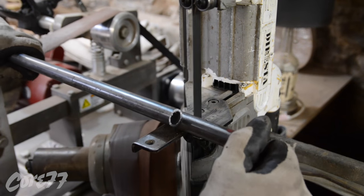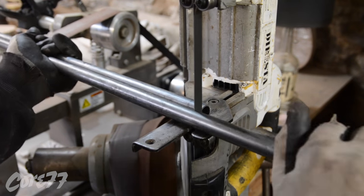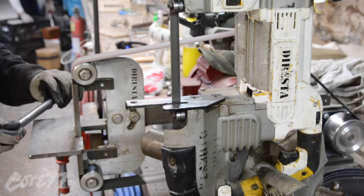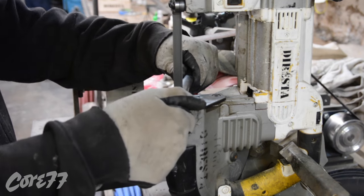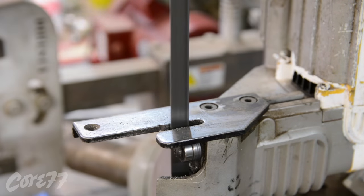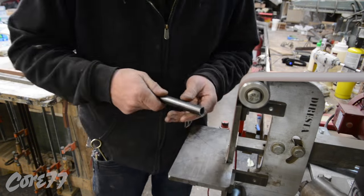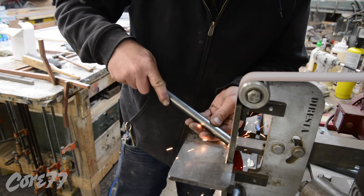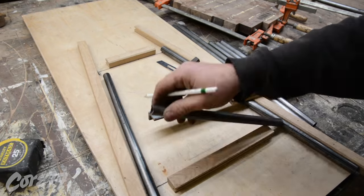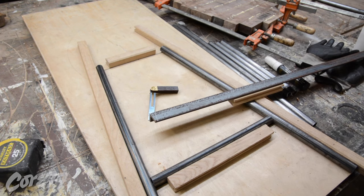I'm using three-quarter-inch steel tubing with one-eighth-inch wall, and I'm using my DeWalt bandsaw — it's an in-vise setup and I keep the trigger clamped on. And there's my Beaumont sander. So I've just cut all the legs, and now I'm cutting the cross members where you would put your feet. They have a little bevel at each side, so I'm cutting the slight bevel and now I'm sanding the bevel to fit around the tube. You'll see in a second where everything fits together — I'm using the very edge of the belt, adjusted so it hangs over the back a little bit. And there, you can see where that goes.